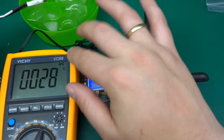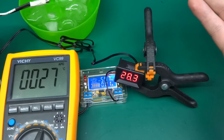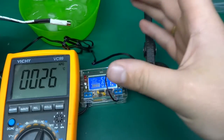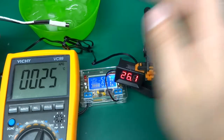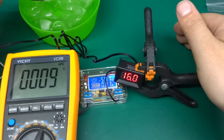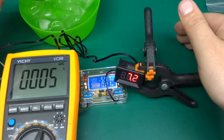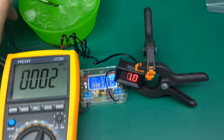I've got a bowl of water and ice. From physics we know that a mixture of water and ice should be at about zero degrees centigrade. This sort of thermistor will take quite a bit of time to adjust in temperature, especially being encapsulated for waterproofing — it has a little thermal mass. The thermocouple is stuck at 2 degrees, and this one is fluctuating between 1 and 0.8 degrees, which is good and to be expected.